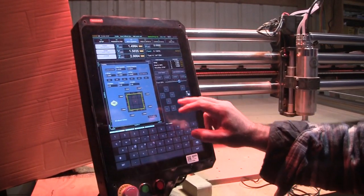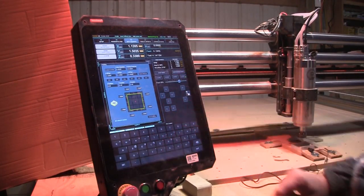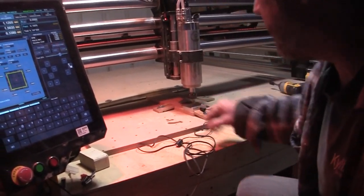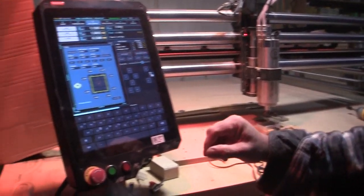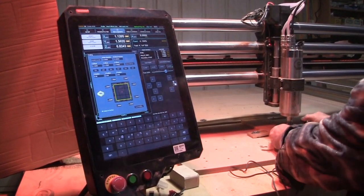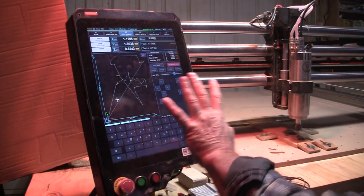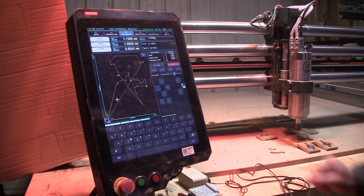Bring my bit so it's above. Let's get the bit above the probe. Put the magnet on. Very important. And hit the button. When that's done, that's all I need to do. Now, like I said, you don't go back and do the XY again. This guy's got a bunch of little things that it's going to go in and hit.